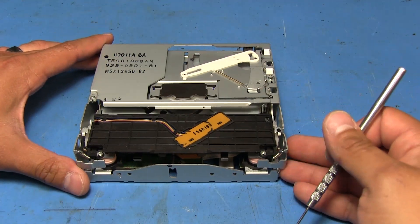The shock mounts are usually pretty easy — you can just lift them up and they pop out. There's a little clip on each side, so if you move it off to the side slightly it helps. You've got to be really careful with those clips because if you force them too much they're easy to break. Just put a slight amount of pressure downward on the mount while pulling the clip off to the side, and if you're gentle enough they just come right off with nothing damaged.